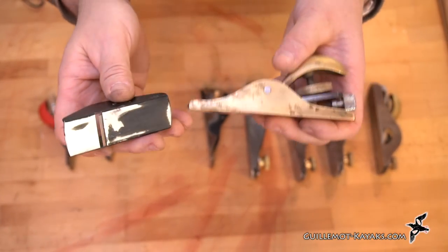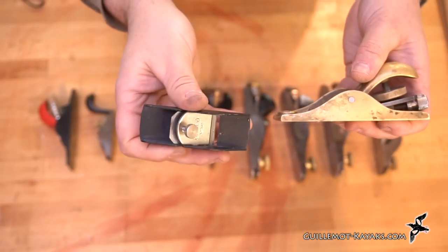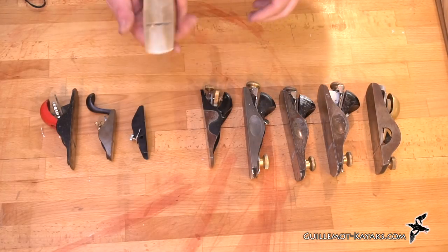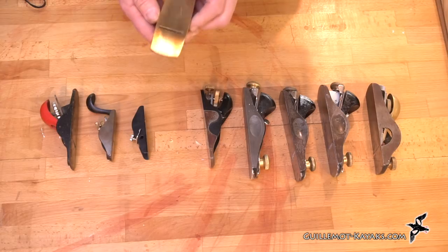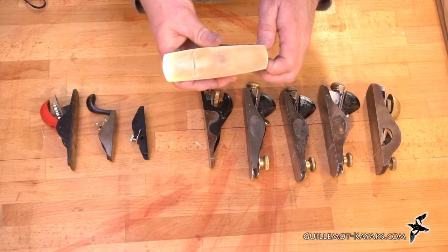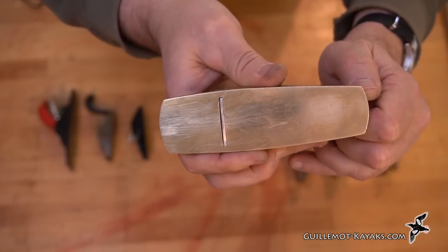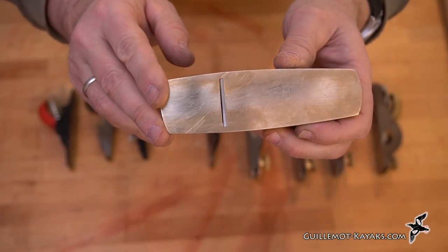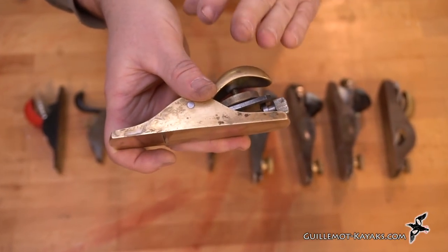What's the difference? Why bother paying $100 when you can make every bit as good a boat with an $8 plane? There are a couple of reasons. The first is just ease of use. A good plane is just easier to use. The very simple thing is adjusting the blade so it cuts right. Most more expensive planes have some sort of depth adjustment screw, and with it, turning one way closes up the blade, the other way opens it. That simple operation is worth a fair amount because you probably have to do it quite a bit. As a general rule, the more expensive planes you actually have to adjust less because everything's held in place better.